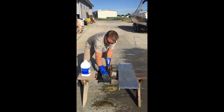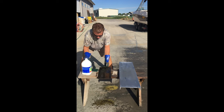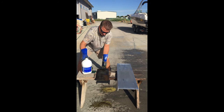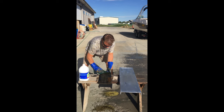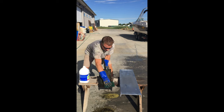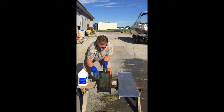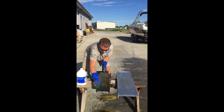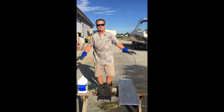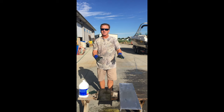It's eating all the rust off. Some of this acid is diluted already, but you can see how it's turning it white. That is ideal for any primer and any coating. The only other alternative to muriatic acid is to shot blast. This is simpler, less expensive, and you can do it yourself.